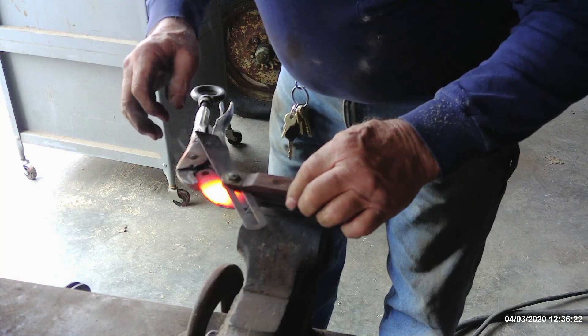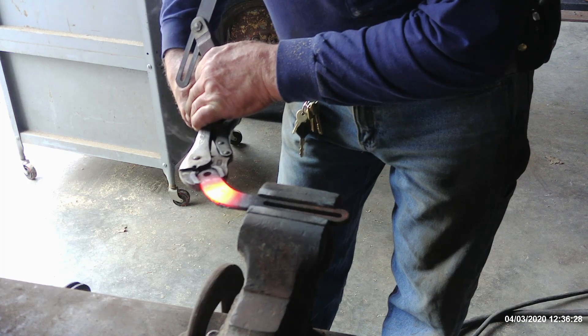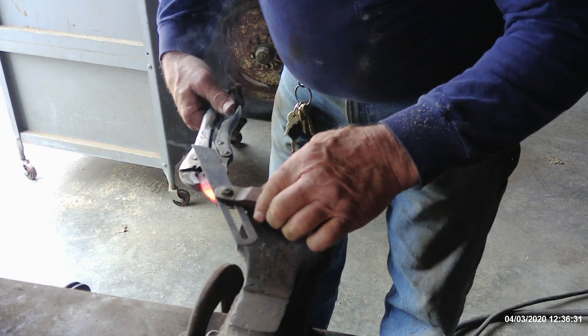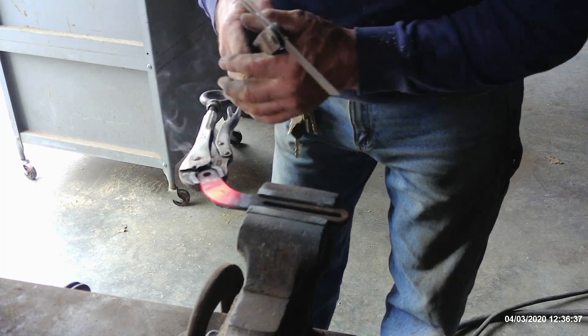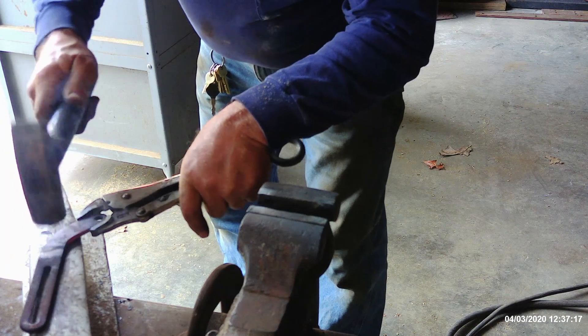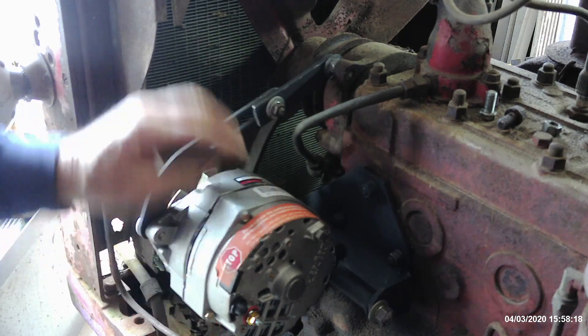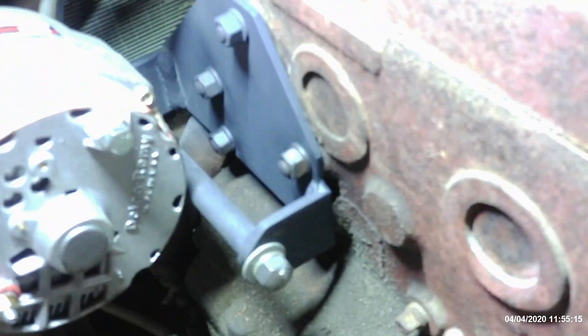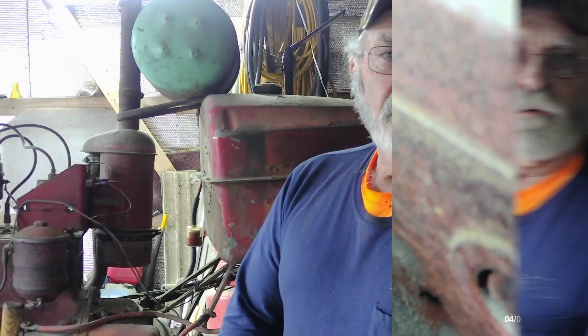That's really fairly close, and this is nominal — it does not have to be exact because we've got a lot of room to play with. I've got a little bit of a curl and a buckle there. I'm going to go get my railroad iron. We now have the slot up here for our belt adjustment — you can see down inside how that bushing comes into play. There you have it — just one quick and simple way to mount an alternator and convert one of these old tractors from a generator to an alternator.